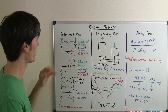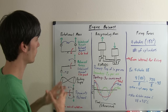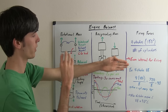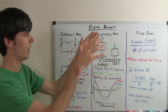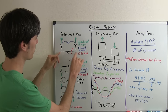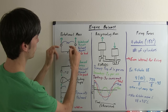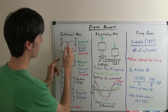Let's get started with rotational mass. What we want to do here is balance all of the forces, all of the moments, and we want the center of gravity to be on the axis of rotation. So if this is your axis of rotation, you want the center of gravity to be on it so that as it rotates you don't have a force pulling this mass around. We're rotating about this line and we've got these two masses here. The moment is balanced because as this rotates, these forces balance out at the center.